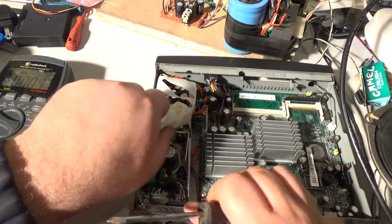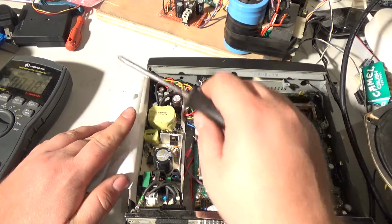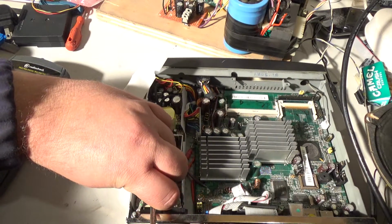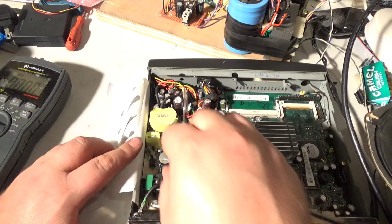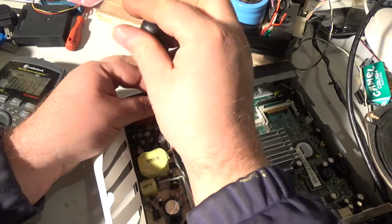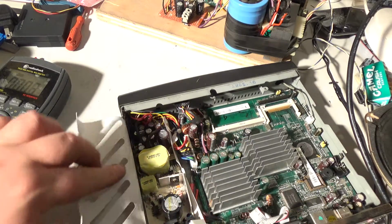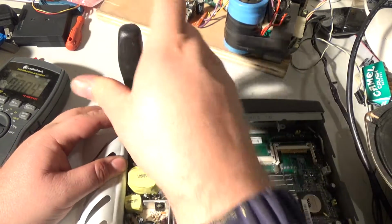I mean, I suppose I could rip this crap off. I suppose I could add another transistor, like a 3055 or something like that, and have the 7805 control the larger transistor for the 5 volt, like in most arcade power supplies. But I thought the VECTREX would draw so little power that it wouldn't be such a big deal. Oh well. We'll use this. This is a nice clean switcher anyways. Alright, let me pull this thing out.